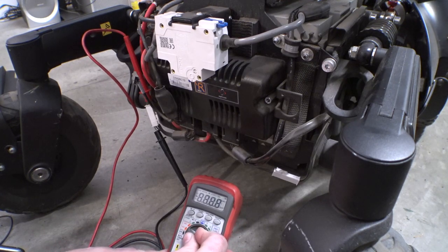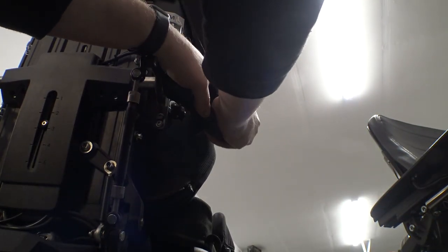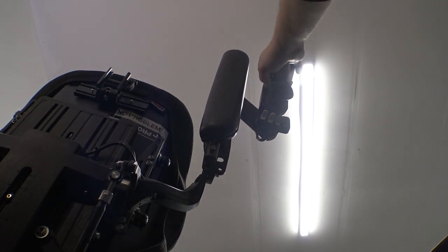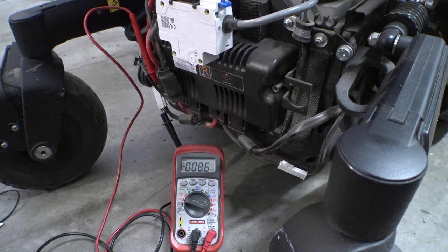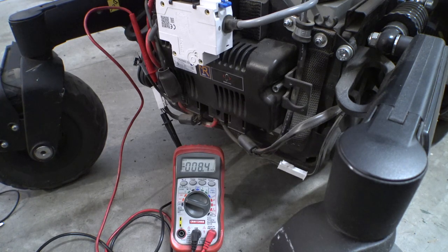Those should be connected — let's turn this to DC volts. I need something to reach the joystick on this chair from here. Fresh out of grabber sticks. I just remembered we have a secret weapon: armrests and a swing-away. There we go, now I can easily-ish reach that. The way this system works is when you're stopped the brake coils are not powered up at all, but the chair is monitoring the circuit for errors. I don't know what the idle voltage will be, but let's turn it on and see.